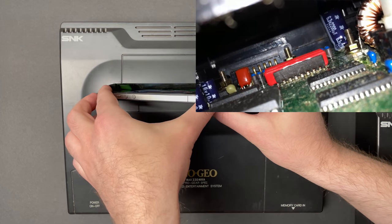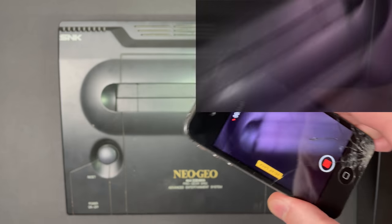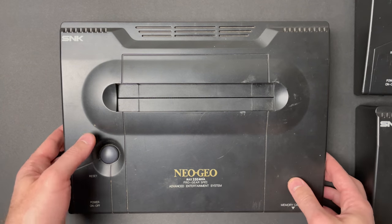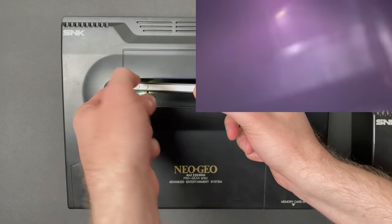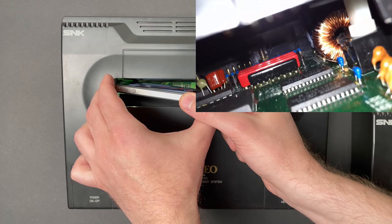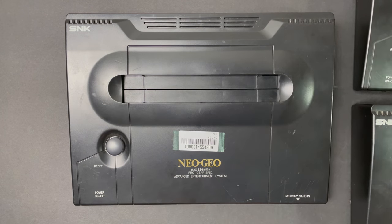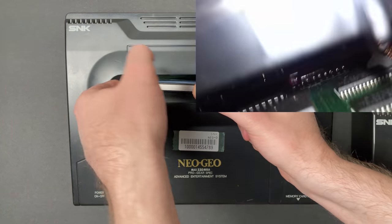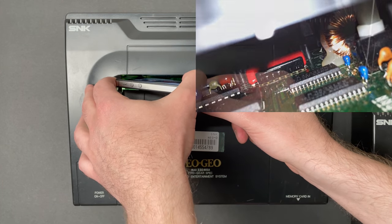One of the additional components that the 9-volt units have is a large coil, and we can see that coil in the corner there. You guys saw it here first, folks. First time on YouTube. You know, for the one person out there that this tip is actually gonna help. But this ended up being a huge time saver for me. I was not prepared to plug these units in without being 100% sure whether they ran on 5 volts or 9 volts. And it looks like all 3 of these units do indeed run on 9 volts.